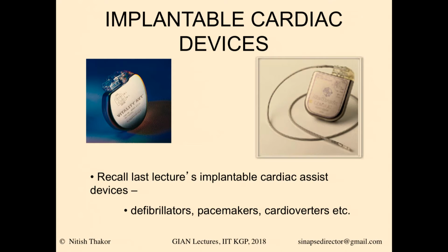The other part of it is this, I used the word plastic, but there are certain types of, there is electronics in there, but you still have to connect the lead, the wire that goes to stimulate. So that connector is very, very challenging, because it is the weak link between a metallic lead and a titanium can, because you need to get that wiring, the electrical wiring, to go in. So what's called feed through.